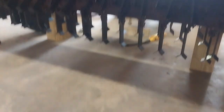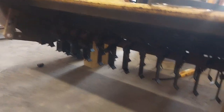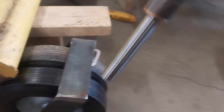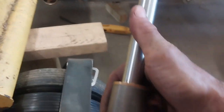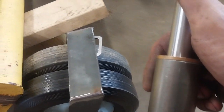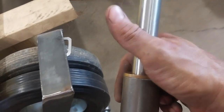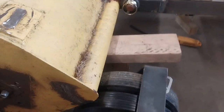The problem that caused is my cut height isn't as high as I'd like. The only way to fix that is by pulling the front up. What I'm going to do is have some spacers underneath with a hitch pin on top. I can undo the hitch pin, pull the axle out, take a spacer off the bottom and put it on top, and that will lower my cut height. That's how that's going to work.